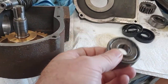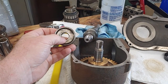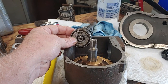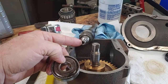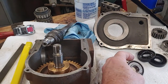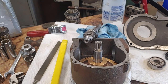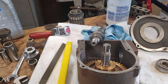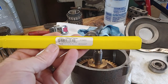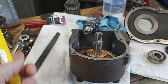And maybe that's not it. Yeah, that's the one. So this is 17 millimeter, or for a 17 millimeter shaft, and this was 16.2 millimeter, and so it was just a little loose. So I turned it down to 0.5050 inches. Actually, when I checked it, it was like 0.5047, a little bit under. And I did that because I have a new reamer here that's 0.5030. Can't read that, can you? 0.5030.